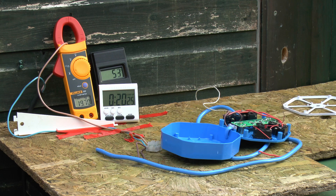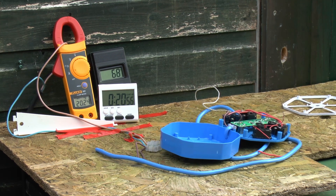I've opened the back and twisted together the two wires directly, because any attempt to use the actual outlets is a failure - they simply fail after a couple of minutes. Power is on, doing about 20 amps, and temperature in the cable is about 60 to 62 degrees and slowly rising. The wires do seem to be a reasonable size so overheating of the flex doesn't seem to be a major problem, although it's already approaching the 70 degree limit for PVC insulation - bearing in mind we are running this at 20 amps, probably more than it was designed for.